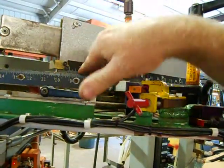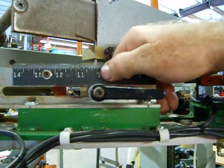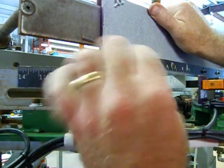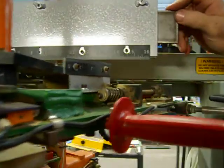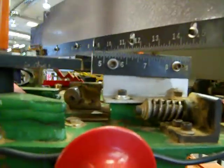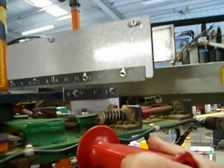This unit is currently set up at a little over 10 inches on the tread, and I can tell that by the hash mark in the brass piece lined up to the scale. So we're going to go ahead and move this out to where it is at exactly 10 inches. Over here on our riser, we currently have six and seven-sixteenths, and we're going to set this up to seven and a half — just to show you how that moves.